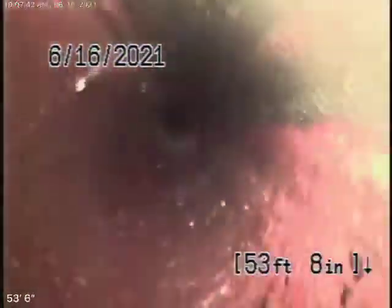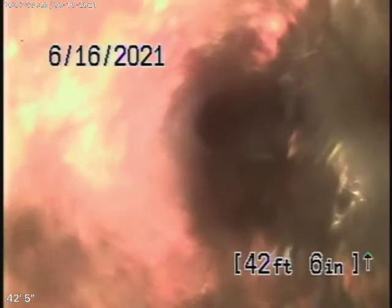We're now running the camera from the right-hand side of the house through a 2-inch roof vent so we can check as much of the line as possible. Right now we've got our camera in the city, so we're going to pull the camera back. There's the city connection — we've seen all this part over here and it all looks pretty good. A little bit of roots that we saw, but there is a clean-out outside in case they grow — you can clean it up. Around about here is where it starts, and the lens is a bit dirty — I'll clean it up.